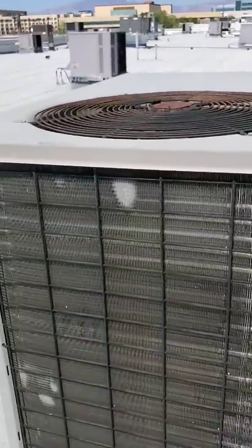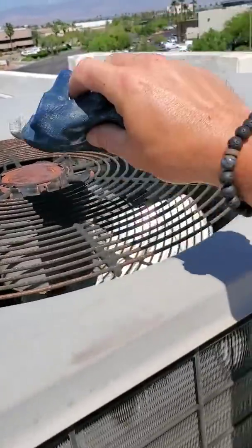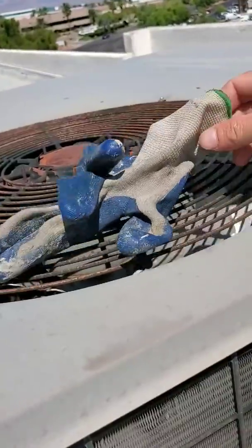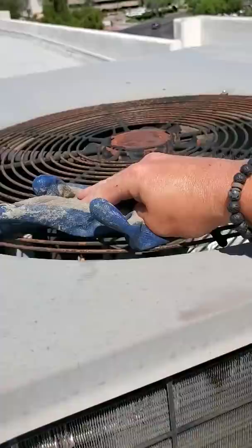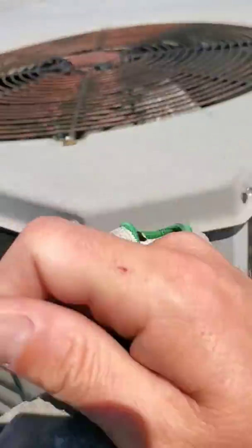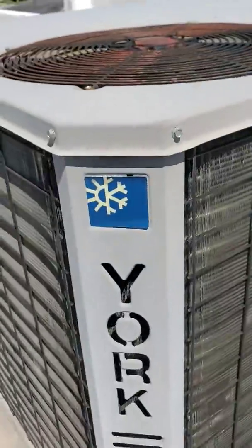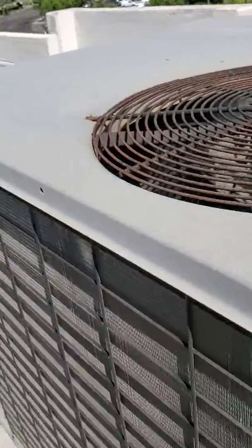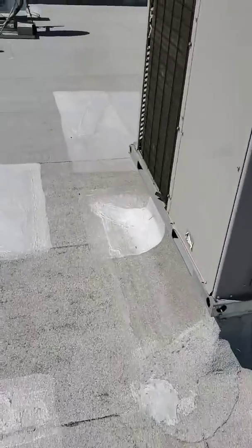So yeah, this one's doing good - it's actually running. I always do this test: make sure your fans are spinning the right direction. If they're spinning out that means they're rejecting heat. I always use the glove method. If it's pushing air up - like it's doing, see, pushing it up - then you know it's spinning the right direction. If it sucks it down, that means it's going in the wrong direction and you have to change the rotation. Rotation: there are two wires right here that are just plug-ins, and you just switch the two - that's all you have to do. Once I shut this thing down I'll show you the wires and how you go ahead and switch the rotation of your fans.